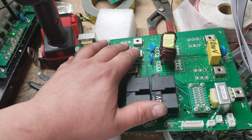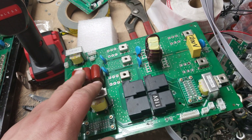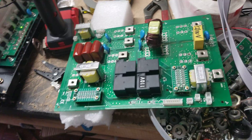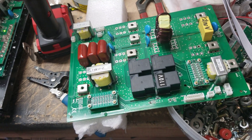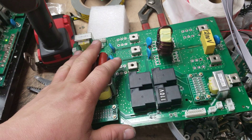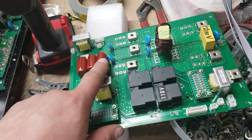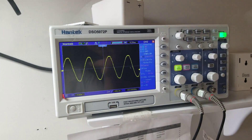Because this wasn't noticed within a reasonable amount of time, this board design has carried over almost three years of inverters and never had any filters on the AC output side — it was just never really necessary. The theory is whatever goes in goes out: all the transformer does is step up the voltage at the cost of more amps. What we discovered through testing is that we can actually install these filters on L1 on the AC output side, and that cleans it up to make it absolutely perfect again.